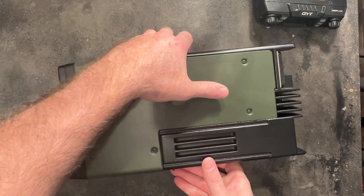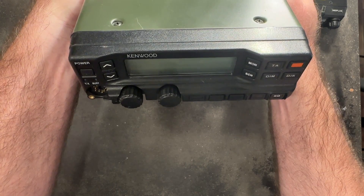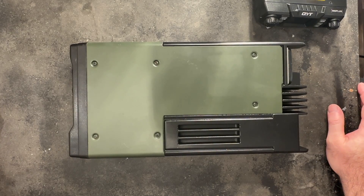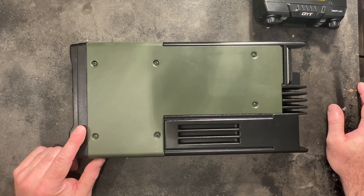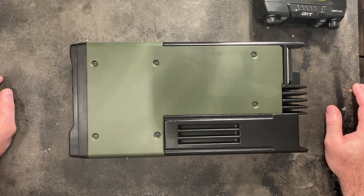This does not have a VFO where you can select your frequencies — you'll have to program your channels in there. When we received this radio, it was in okay shape but needed some love. It was out of tune, so it went on the bench and got retuned, completely cleaned up, a custom paint job put on it, and then programmed up. We did modifications — this particular control head does not include internal speakers, so we wired an internal speaker to it, and made a few other changes to the electronics to make it more suitable for our needs.